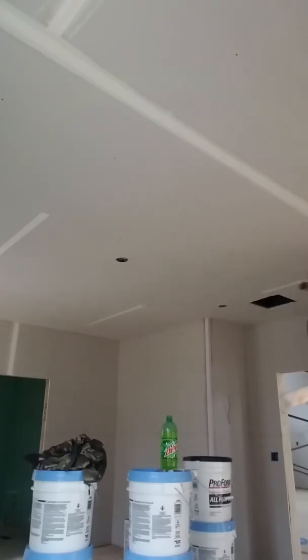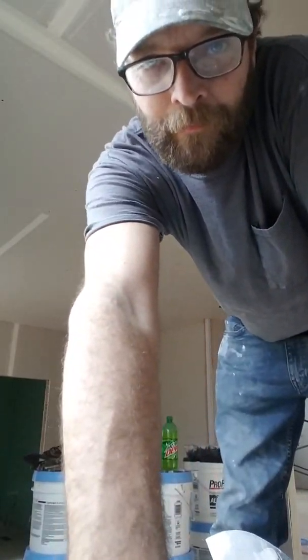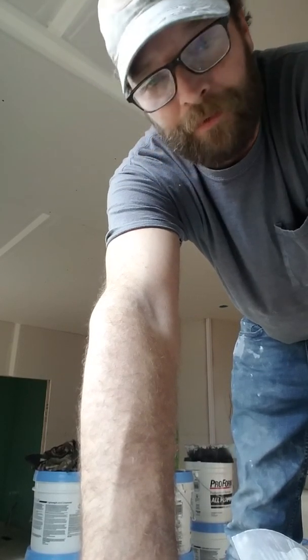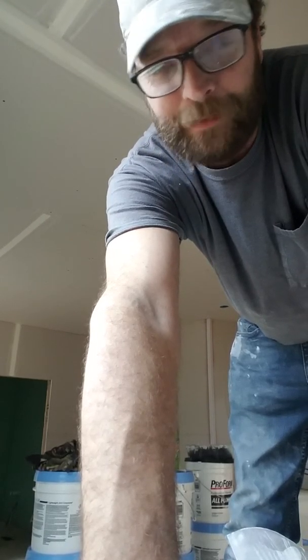Now, I didn't take the whole lid, but I took a good little bit of it in five minutes. I'm going to tape out the rest of these sheets and hopefully for some of you new guys you picked up a trick. The fastest way to tape that I know of is with a six and an eight up on the flats and butts.